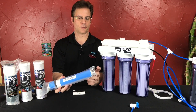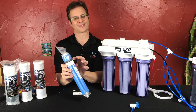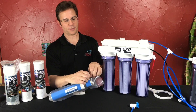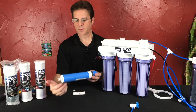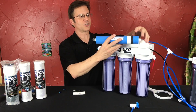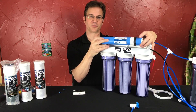When you get your membrane, it will have two O-rings on one end and then a big flat type of gasket material on the center — that's important to know about. When you open it up, you just have to tear the packaging, extract it, and you are ready to install this guy in your membrane housing. It is going to go in your housing in this direction, and you cannot put it in backwards — it won't work right.